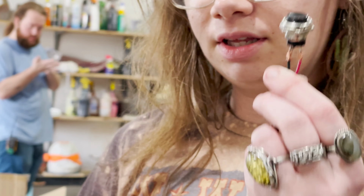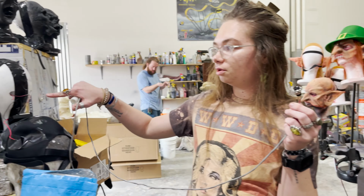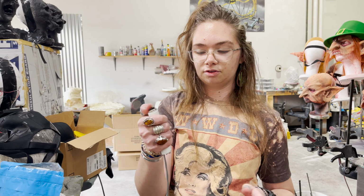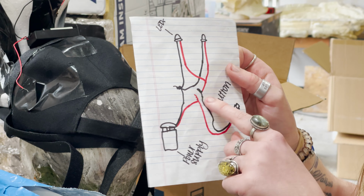And then before you connect your wire button to your LEDs, you want to make sure that you have your pre-cut button holder. It is just cut PVC pipe. Eventually we'll just hot glue around that to hold it in place. You want to make sure this is on before you wire it to your LEDs. We have our red LEDs going to our black button wire.